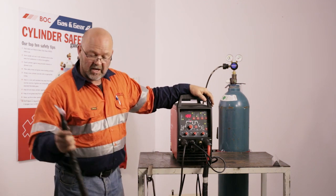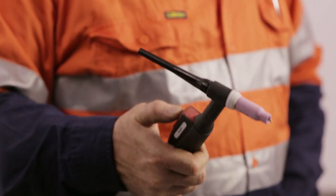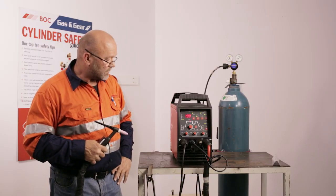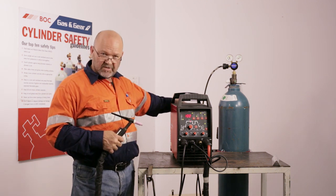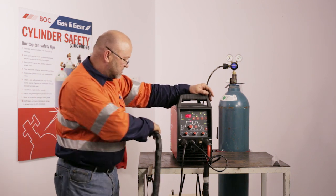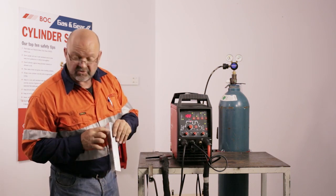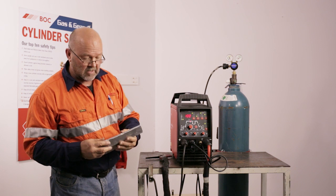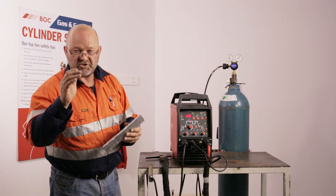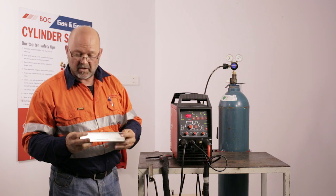The torch itself — there are two types available. This one is an up-down torch. We do also have a torch where you can change your amperage on the fly as you're welding. It's a very basic setup — you've got a high frequency button on the back which you can turn on and off. We do get some nice results even on fusion welding, just doing corner-to-corner type welding without any filler wire. You can dial in your time on and time off for peak and background current and get that nice scalloped effect — people love the appearance of TIG welding, and it's one of the cleanest welding processes we have.